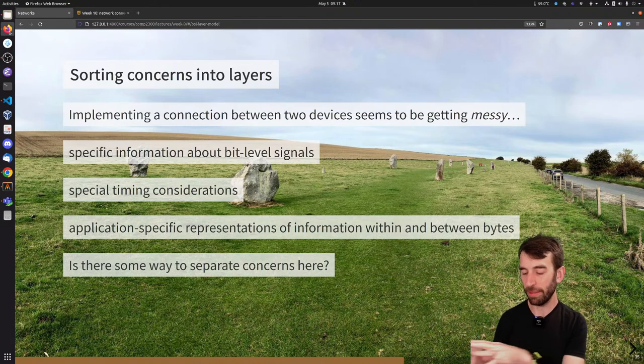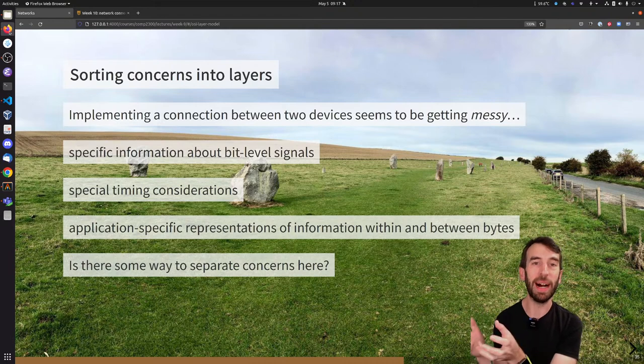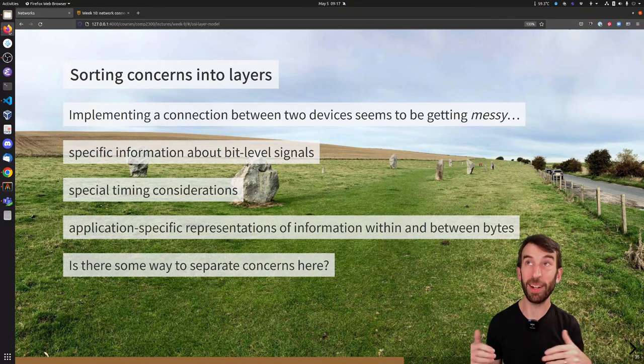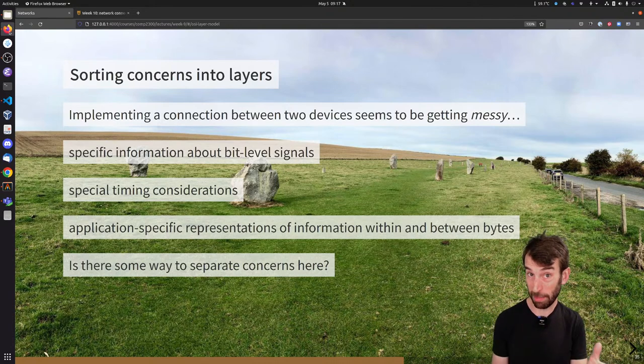So maybe there's some stuff that just deals with the GPIO levels being low and high. That's one very low abstraction level. And then a middle abstraction level that deals with assembling the byte that has to be sent at one time. And then another higher level, which is saying, okay, please connect to another device and be ready for sending bytes. And then another layer, which is just saying, connect to a MIDI device, send the note 60. So that assembles the message of 3 bytes. And then a layer above that where there's just a button, I press that and it plays a note on my synthesizer. So there might be some way to sort out these different levels of network communication and separate concerns